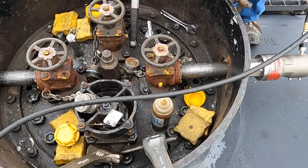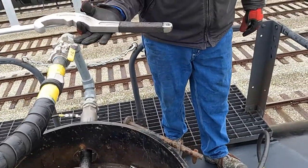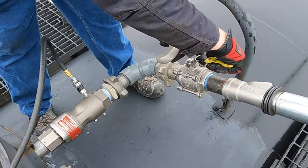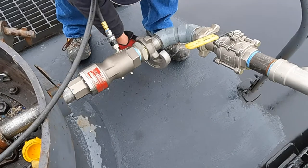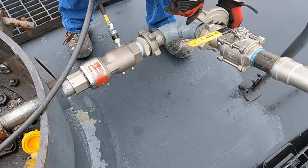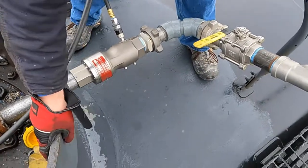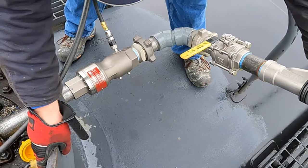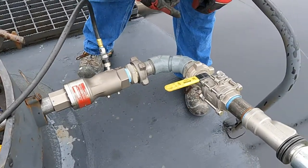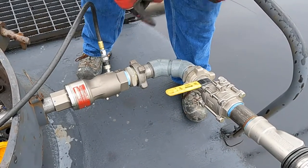When things are pressured up, I always use the spanner wrench to break my acmes loose. So we go and we shut this off. Take your acme. And if it's really pressured up, you can toss the hose like that — it'll drain a little faster. Now that it's done, we listen for just a second to see if you still hear it hiss.